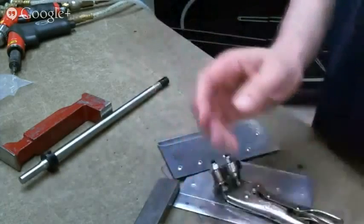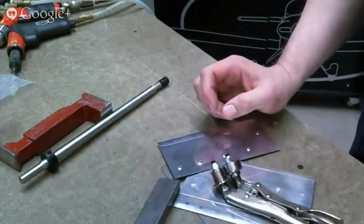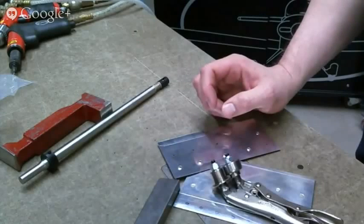There's a double nut inside of the pop rivet puller, and you should be adjusting that double nut so that as the rivet pops, that nut is almost up against the stop, and then it will just go click. If it's recoiling on you, the tendency is to slam the tool back into the material because you're pushing on it trying to keep that rivet tight, so then it recoils and you hit it. So if you adjust that double nut, it'll change your life. It is really nice to use that tool.